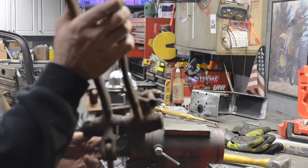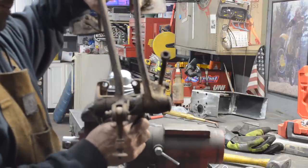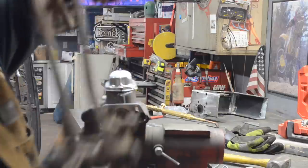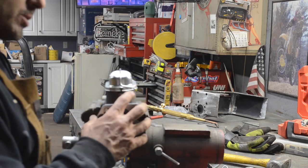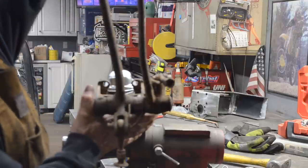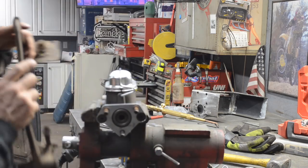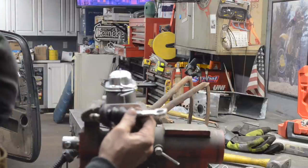So now these pedals are going to mount onto that adapter. And you put your nuts on here and then you're good to go. So the adapter has to bolt onto the master cylinder, in order to adapt the pedals onto this plate. And then, like I said, those simply slide on. This is the rod for the push rod, for the pedals, for the brakes rather. I'll replace this with this plunger here. This was supplied with the master cylinder.